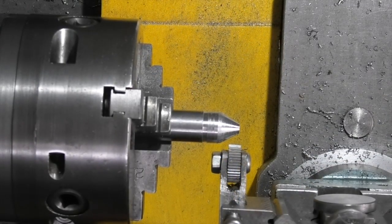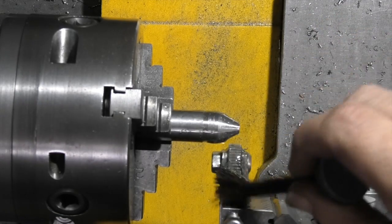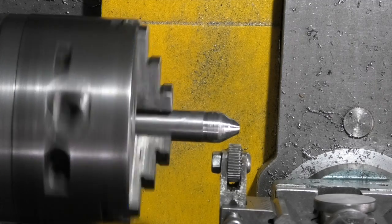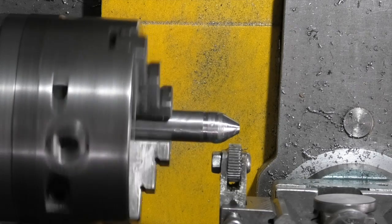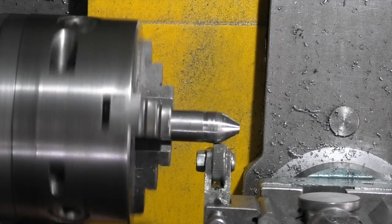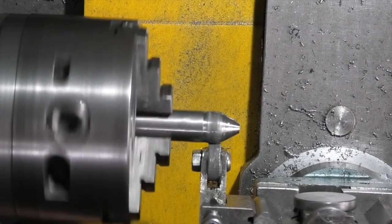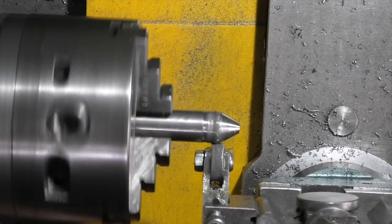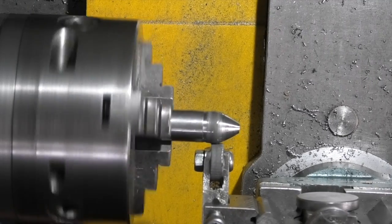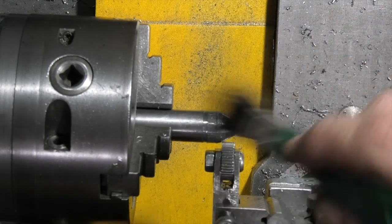I've fitted my knurling tool - this one is an old one, it was just a knurling wheel placed in the end of a turning tool. I'll put this on slow to see if it will work. I'm feeding it in, moving it along, to see if it's doing anything - and there it is, it's just starting to make the pattern.